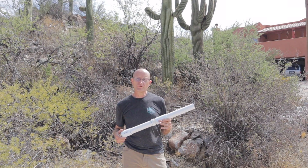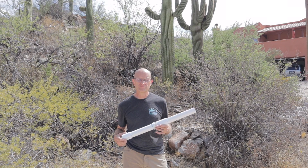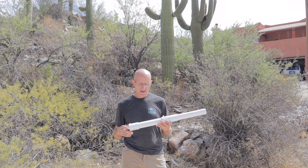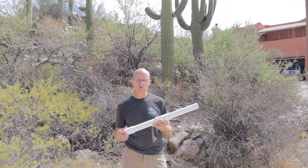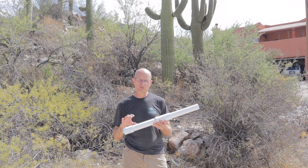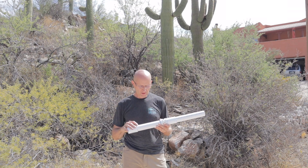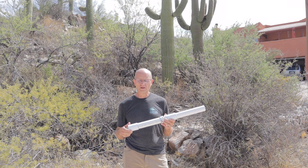This one took me a few tries to get right. I built about four of them to work with the new foam generator. I thought I needed to build a much bigger diameter and I went up to two inch, tried a few different designs and they just didn't work — they built up too much pressure internally. So I bumped it down to inch and a half diameter PVC, whereas the original one I built for the small foam generator is inch and a quarter. This one solves a lot of the problems of the higher output.